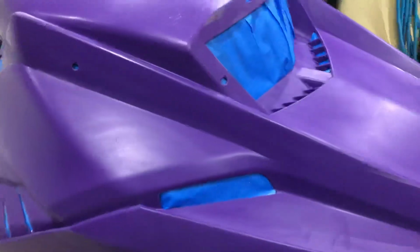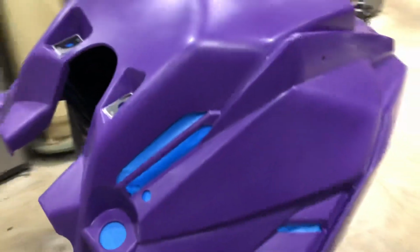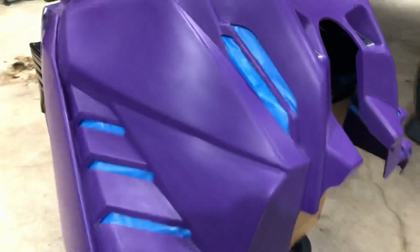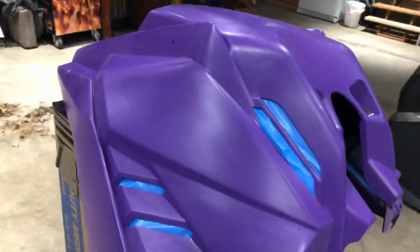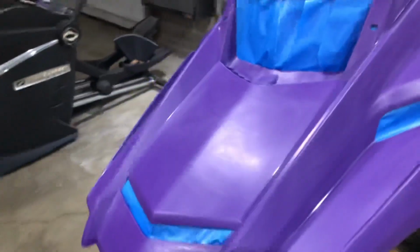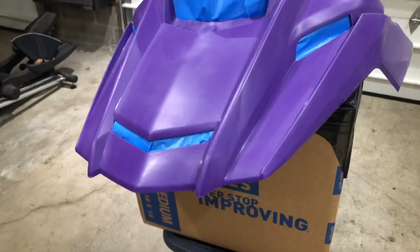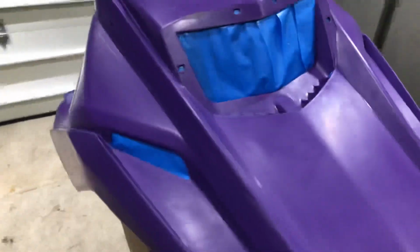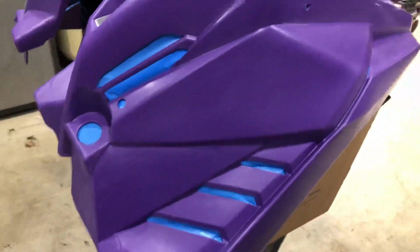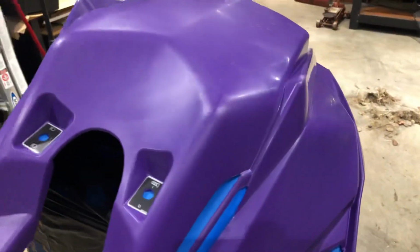So we'll put on one coat of paint, wait about 30 to 45 minutes, put on a second coat of paint, and gauge from where we're at there. Give it another 30 to 45 minutes, and then we'll probably go for a third coat if needed. After we wait that other 30 to 45 minutes, we'll hit it with a clear coat lacquer, clear coat spray. Do that one time, give it 30 to 45 minutes to set a little bit, and hit it again until we get to the brightness and shine that we want to see on the outside.